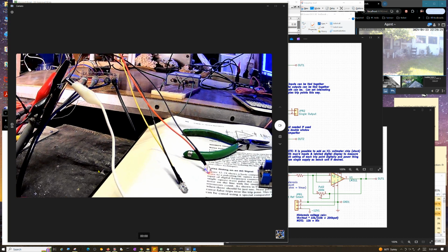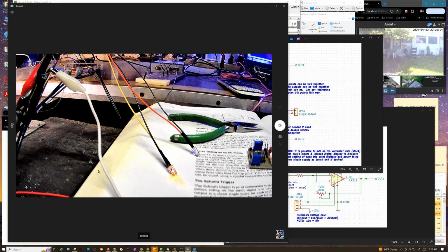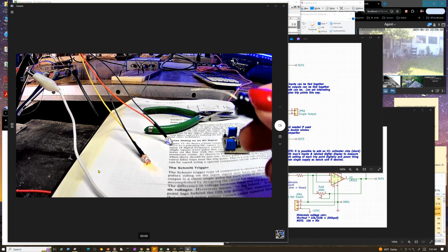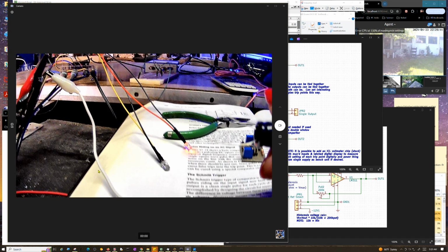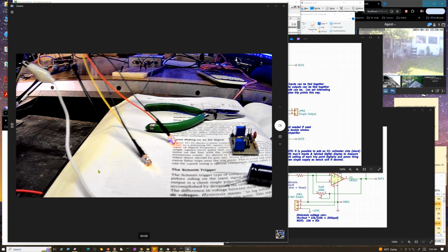Well, that was actually causing the capacitor to go into reverse conduction, because I had the positive side on the signal generator like you'd normally have it, and the negative side attached to the board. But yeah, that was causing the capacitor to go reverse bias and therefore act kind of like a short, so I couldn't get the voltage higher than like 3.5 volts with the divider in there.